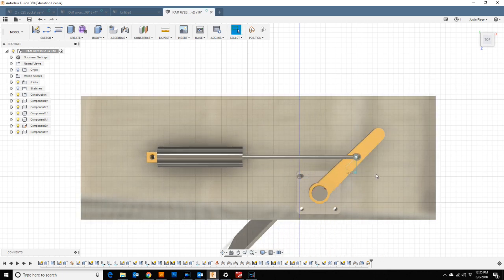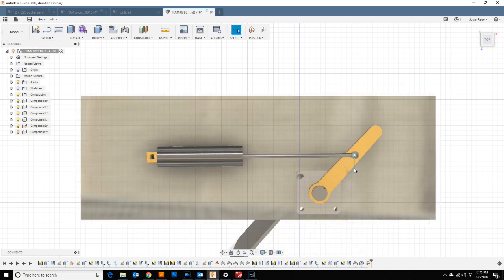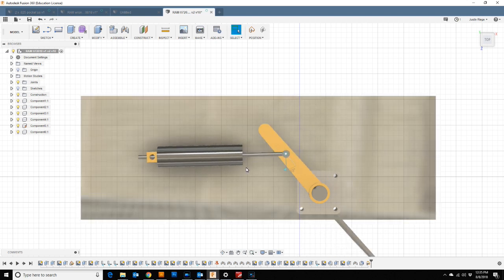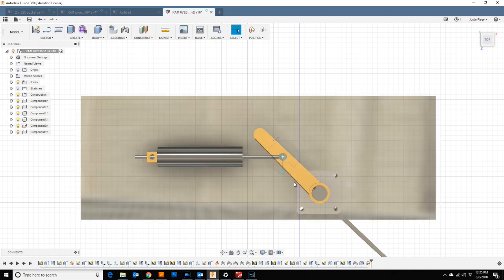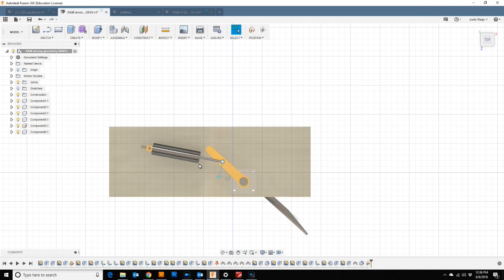design geometry. We have a 3D model here. And you can see it cycles through nicely when the steering is at any of these positions. There's always a good angle here. And even at the extreme, there's a nice angle between the tiller and here so that this can't go past that point. And I'll show you, if you put this too far out, you can see what could happen is you come over here and all of a sudden there's not a whole lot stopping this from snapping past that point.